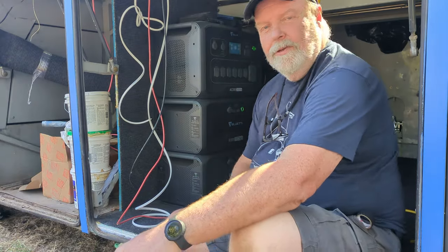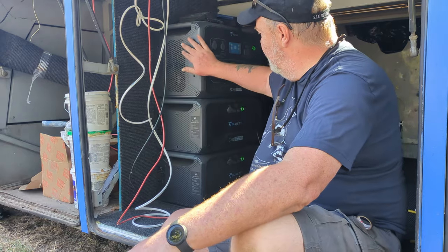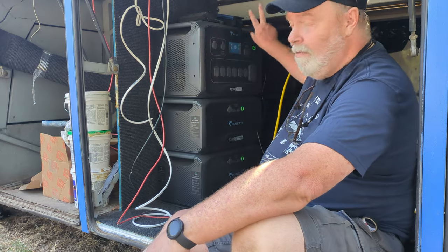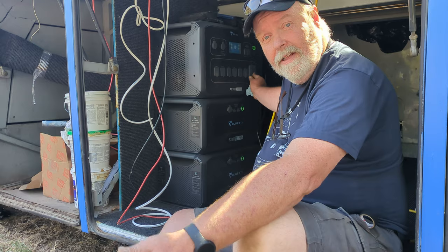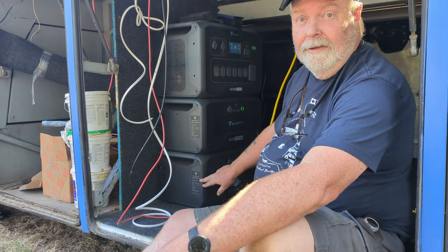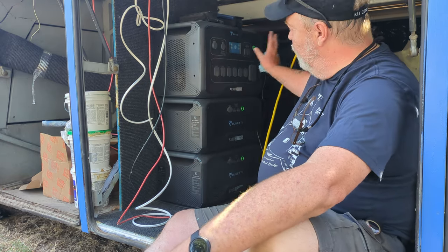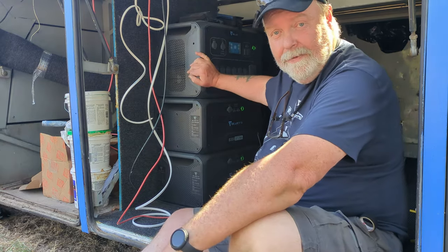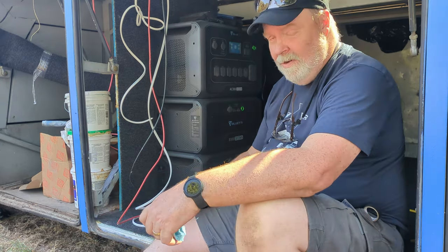So why did we do this? It's comparable to component systems, and there are pros and cons to both. If this unit fails for whatever reason, because we have two AC 300s, I can actually run both load centers off of one 30 amp outlet. That cuts our available power down to just the 3,000 watt inverter, but we'll still have the 12,000 and change watt-hours available because all four batteries can run off one unit and both load centers can run off one unit — so long as we don't run the washer-dryer and the induction cooktop at the same time. Then we just send the failed one in for service. If both fail, we'll have a small generator backup.